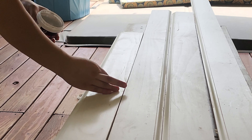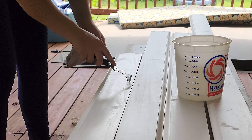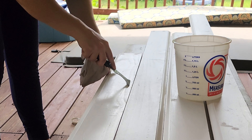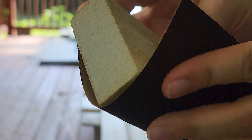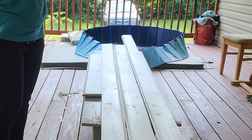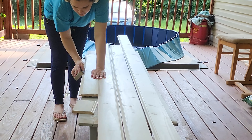We can use wood filler or spackle to fill any nail holes or imperfections — I used fast and final lightweight spackling. I noticed on the container they recommended using a wet putty knife for a smoother finish, so I gave it a try and it worked quite nicely. Once that dries, sand everything down — I like to use a piece of sanding paper wrapped around an old sanding sponge, using 120 grit here.